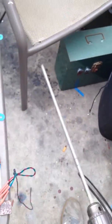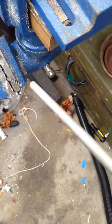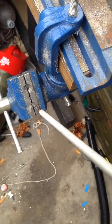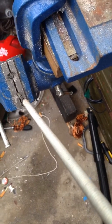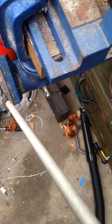Then you take a smaller bit, something like this one here, and stick it in the vise. After you've started your center drill hole, the stock spins and it can't spin off center — it always finds center. The faster you keep it spinning, the more centered you'll be, and that way you're concentric when you're drilling your hole.